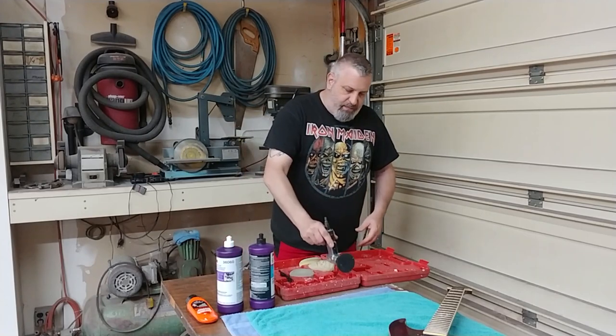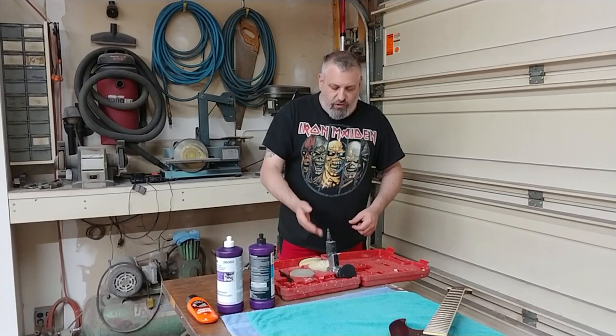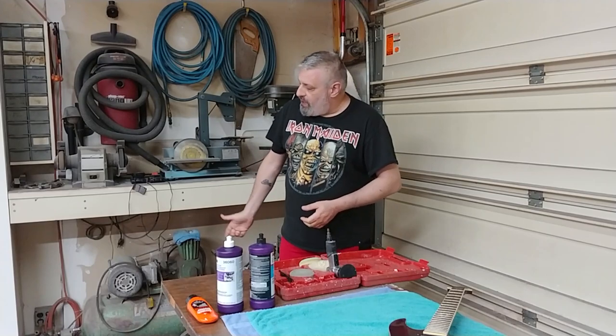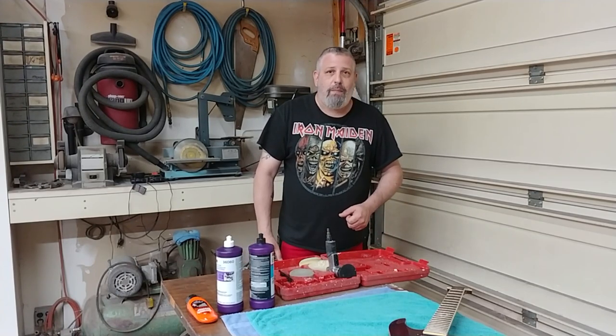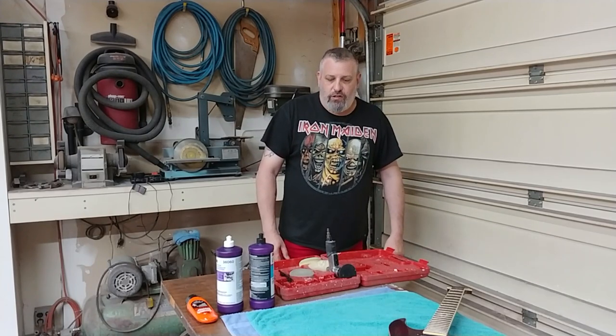Now I'm going to let this sit up like that for a little bit and let the oil go down into the mechanisms that make this air tool work. When I connect the air pressure to it, it's going to force that oil into the gears. If you add too much oil to one of these or any air tool, you'll have oil coming out of the air tool, and that can become a problem with what you're working on. So let's get to it.